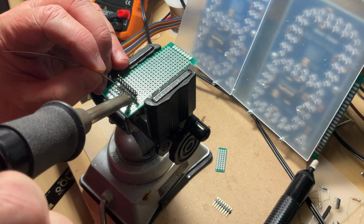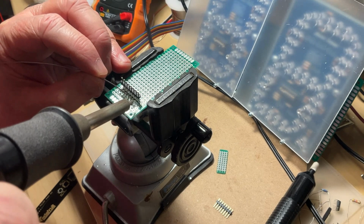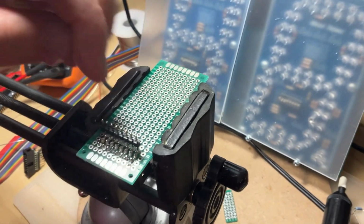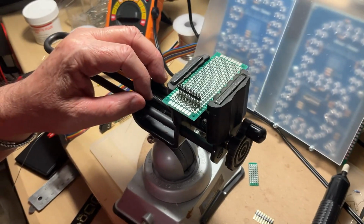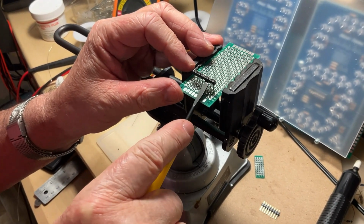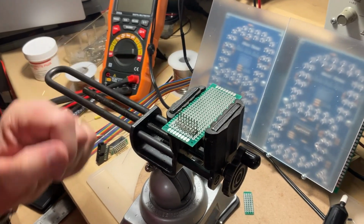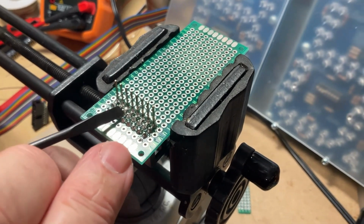When there is enough solder between the two, they are going to join together. One more. So you see, these ones are done, okay? And in the moment they are done, you can try gently to remove the piece of plastic. It's still warm, and this is why it's going out easily. So you've done one row, okay? So as you can see here, between the inner contact and the external one, you've made links.